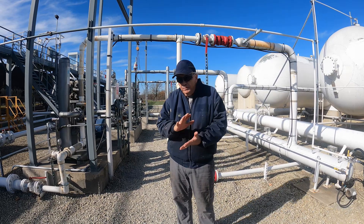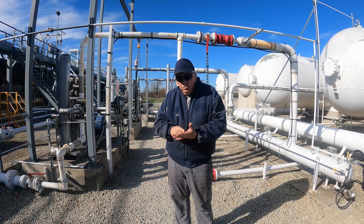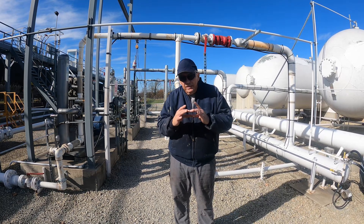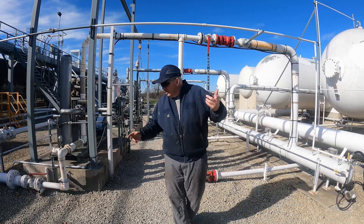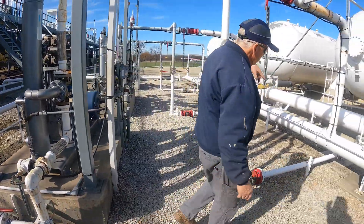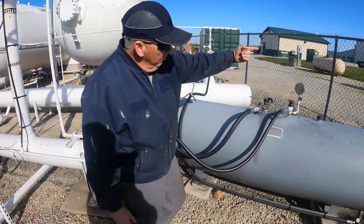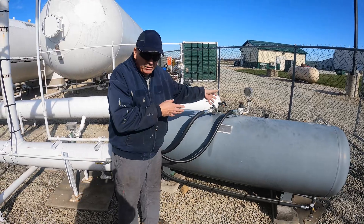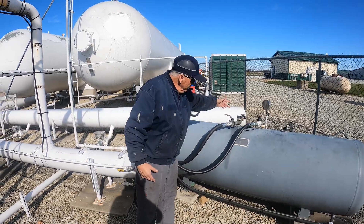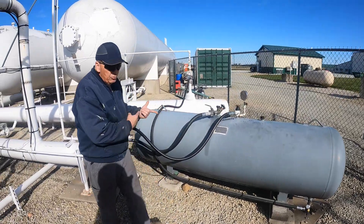I've got a video on entrainment and another on my scavenger tank for the compressors. The scavenger tank also works in a loop — it's a component that sits in a loop. I have a basic setup like this on all three of my compressors: a rubber hose comes off here, makes its way over to a three-quarter inch schedule pipe that goes into here, so I can drain from my compressors into this collection point.